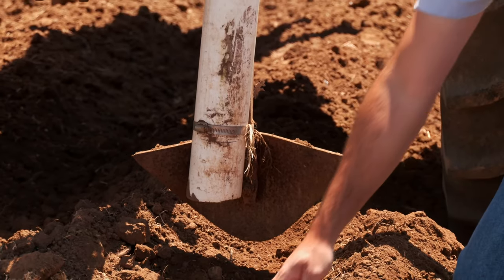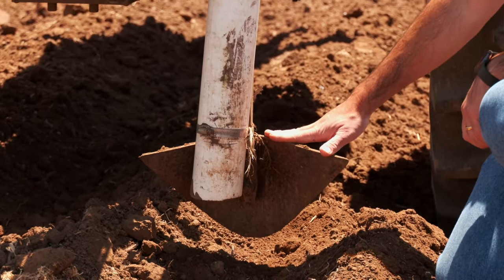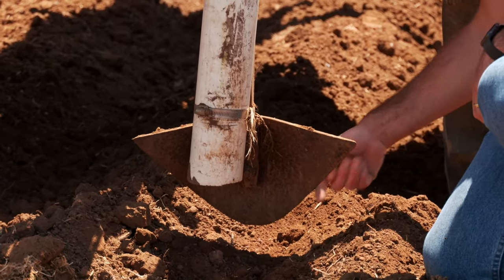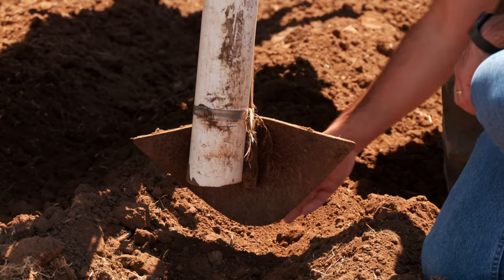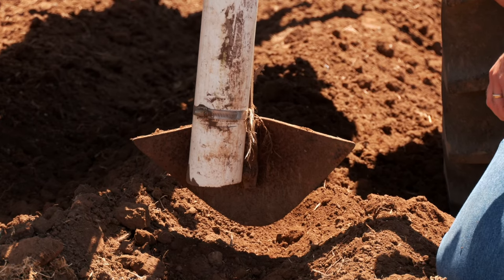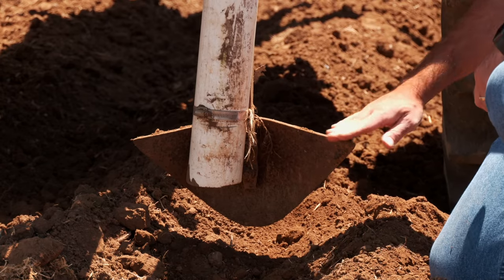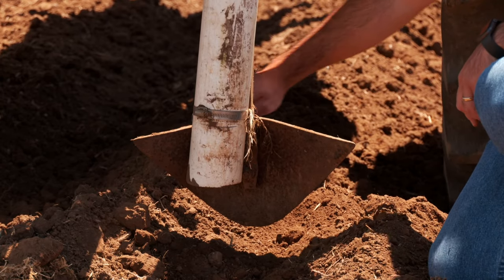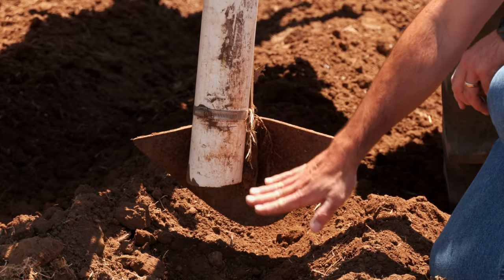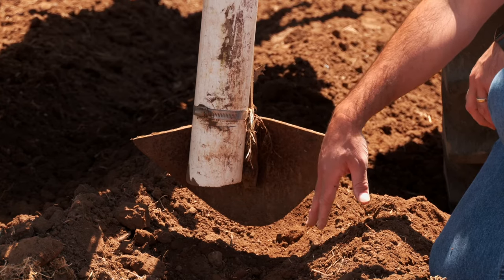The particulars of this planter: the shovel we use is an Alabama shovel. What makes it that specific type is that it has a point like all shovels do, but most shovels have a high back to kick soil really wide and far out. These Alabama shovels have a nice flat top — what that does is make a nice trench but allows a lot of that soil to just flow over the back, so there's nice loosely aggregated soil where the potatoes drop into.